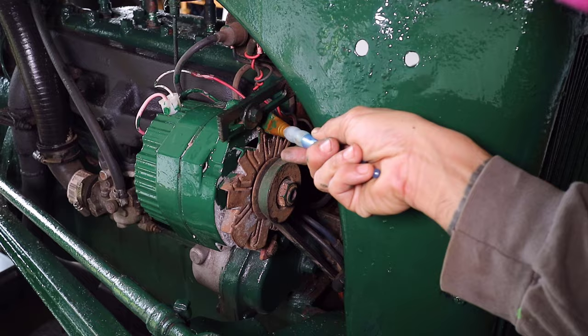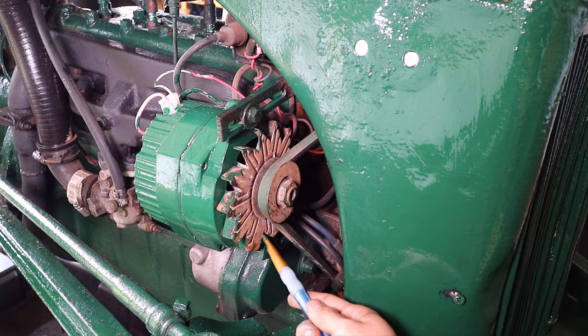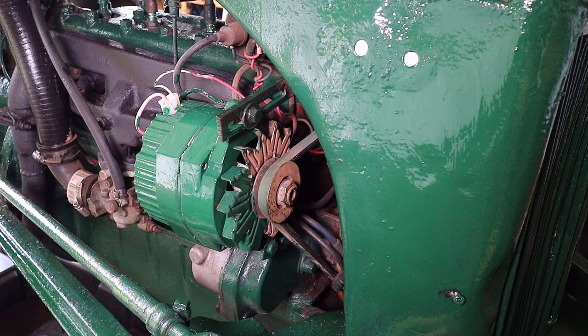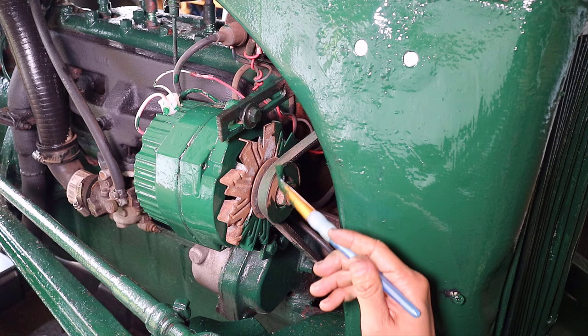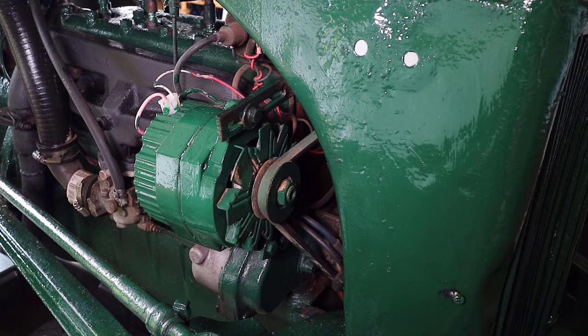I also painted the front end of the alternator. Anyone who knows about paint knows this will start to rust within months to a year — without proper preparation, rust will continue to grow underneath. The only way to truly stop and protect it is to get down past the rust to bare metal. That said, this has made a difference in my eyes, giving me a glimpse of what the project will look like moving forward, and the new color gives consistency to the whole tractor and will keep me motivated to continue working on it.